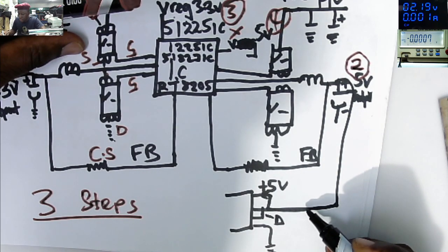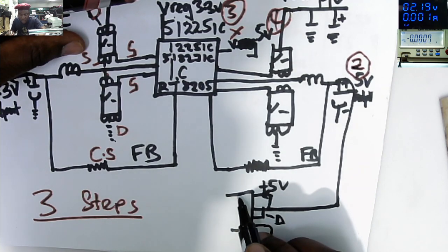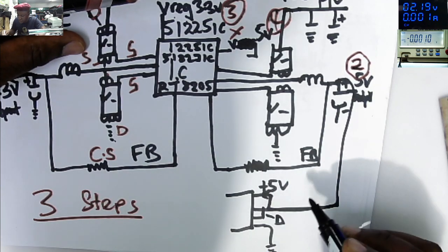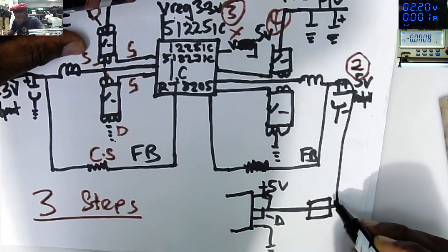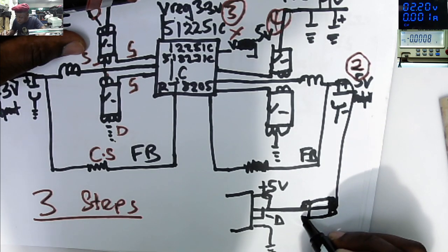But this 5 volts is not just passing from the 5 volts power supply straight to the USB. Between this, they use a chip, like a MOSFET, a small MOSFET. Yeah, that's what we found here. Four pins together, here three pins together, and the gate.